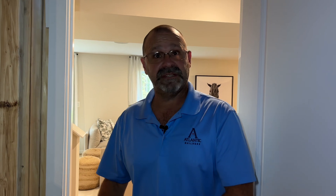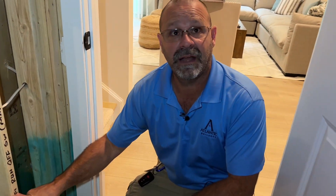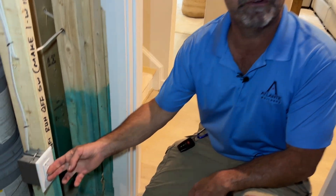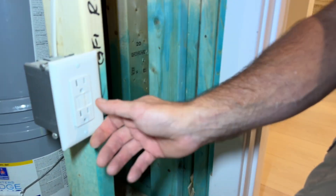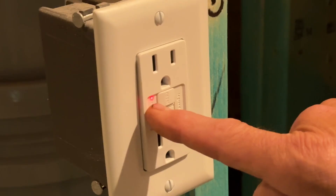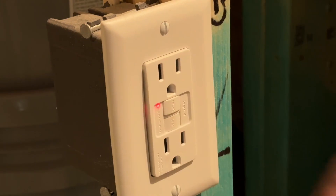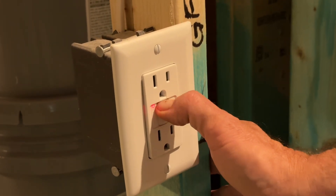Next, we're still in the basement and we're going to look at GFCIs. You've got one of these in any sump pump or any hung sewer in the basement — this one is for your outside lights. It's a good idea to check these once a year. Just hit the test button. You'll see a red light right there, which tells you the GFCI is working. To reset it, just push that in. If this light goes back off, this means the GFCI is great to go.